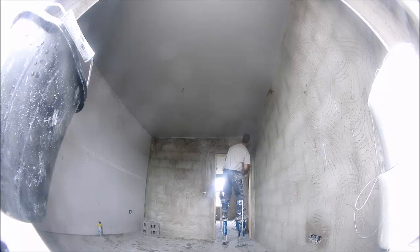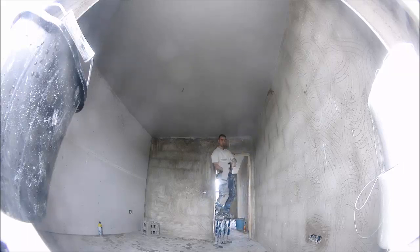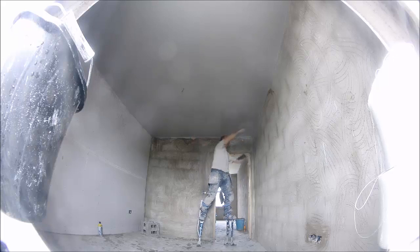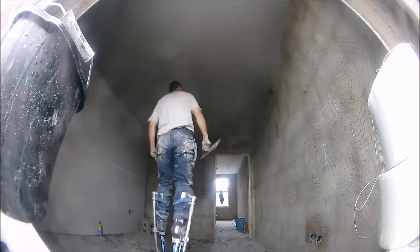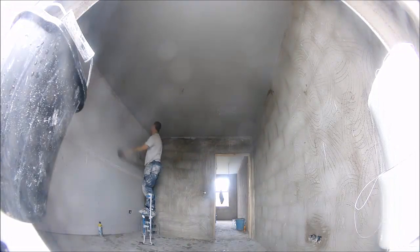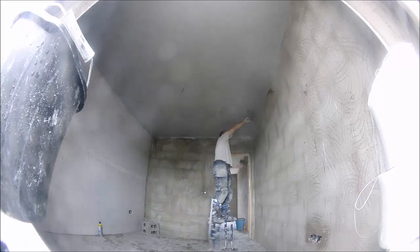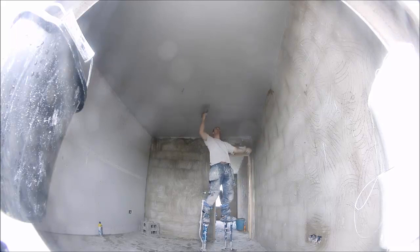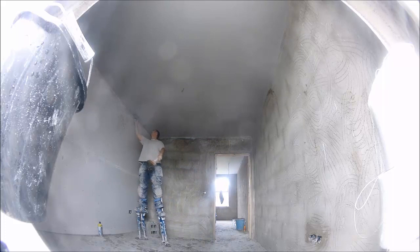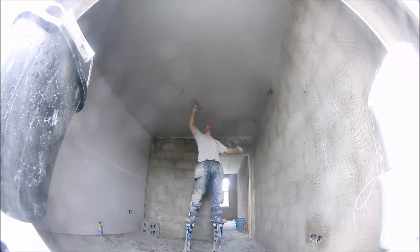What you're doing is taking all your dirty water with you — there will be some water on the ceiling and some lines, and you're taking them all back to the other angle where you'll flatten them in. Over time, if you are an apprentice doing this for the next year or two, you will learn to look at the ceiling and know how dry it is. The best way to know if something's ready is to touch it — you will feel the moisture has left it a bit and then it's ready to go. Don't be scared to get your hands dirty and press it; if you're leaving a mark, it might be just slightly too soft.